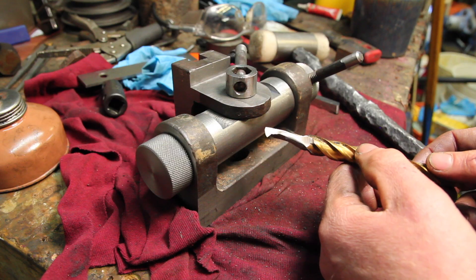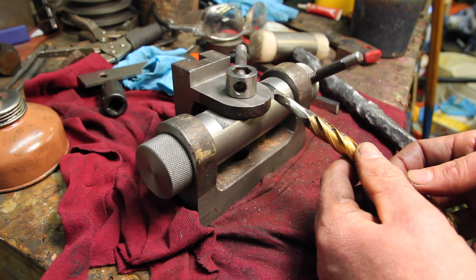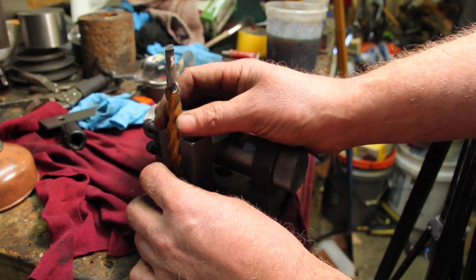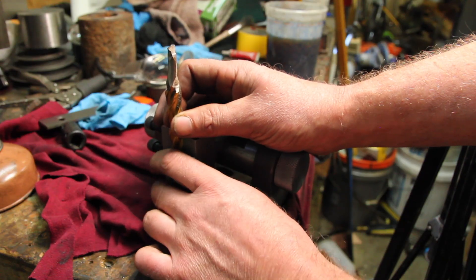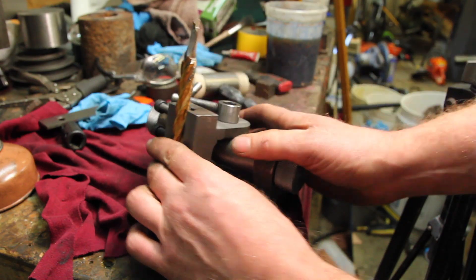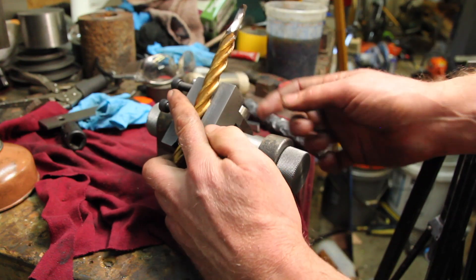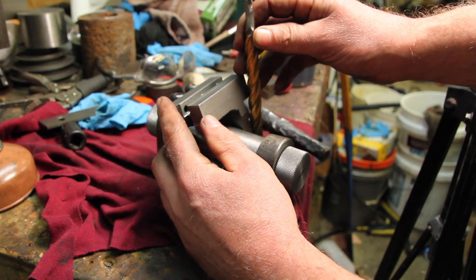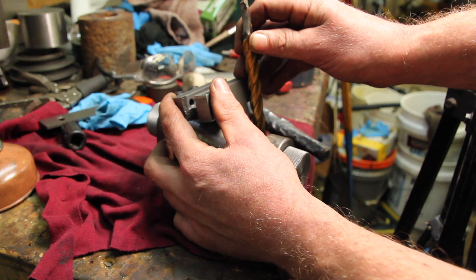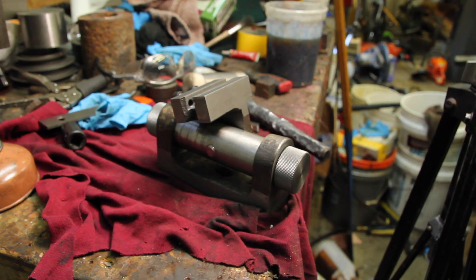So this abomination is an internal threading tool that I made out of a broken end mill. I was thinking I would clean this up, but one limitation is that when it's set up at a steep angle you don't really get a relief angle from it. So at some point I'll probably go back and make another piece that will mount like this so I can get my angle and lean it this way. But for now I'm going to call that done.